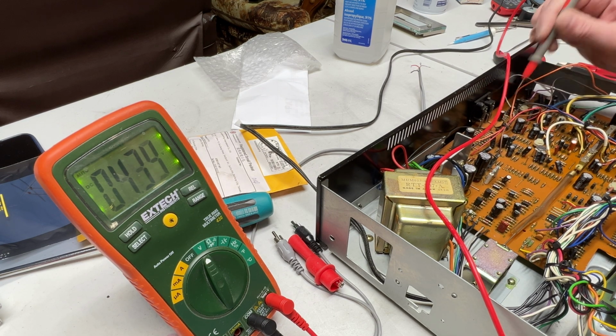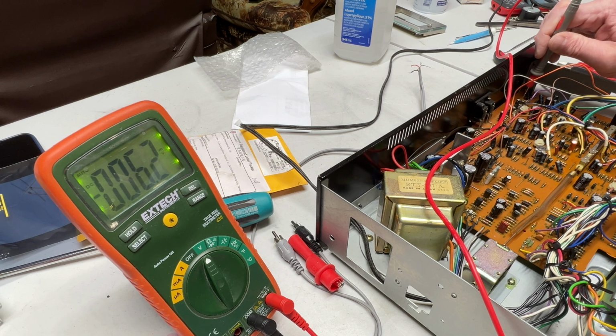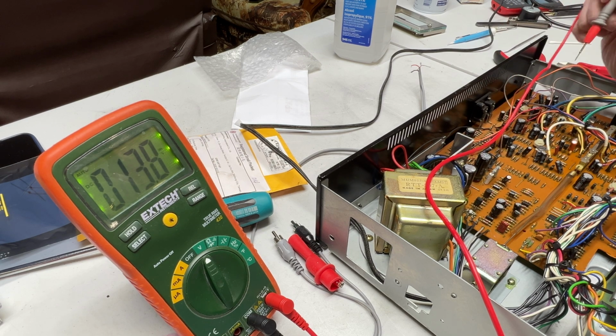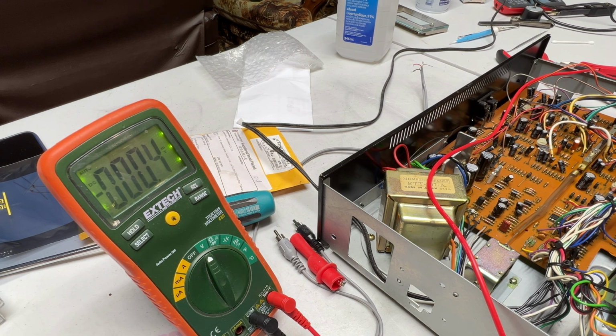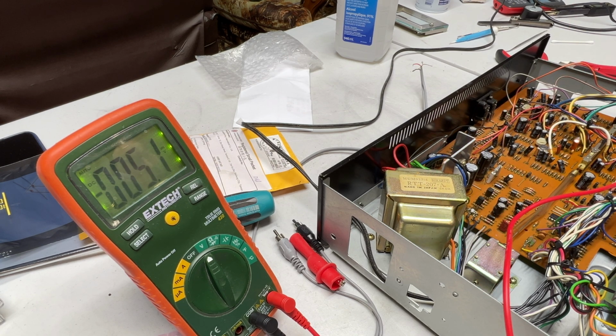4.3 volts, and we'll try the new diode. 1.3 volts, so that's not the problem. Terrific. Let me check the service manual again, and we'll continue to trace backwards till we find this. Okay, so C249 and 149 are the next to check. They're directly in the signal path before those two diodes.